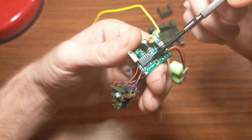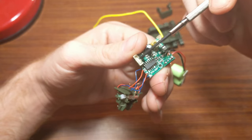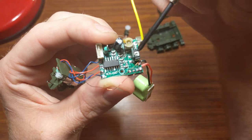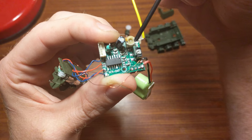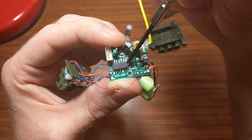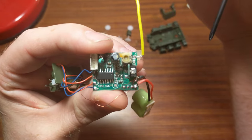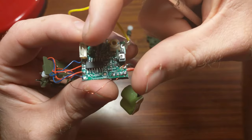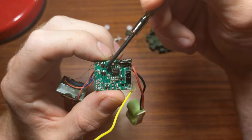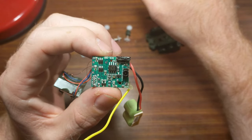This chip on the other side of the board is fairly obviously the chip running the whole show — partly because it's the biggest. This would be running radio communication and the infrared setup, and it's almost certainly connected to the motors. Whether this chip is an ASIC or a programmed microcontroller is hard to say, but I'd lean towards the latter because custom silicon is expensive. There are no numbers on the case — they don't even look filed off, just never there to begin with. Flipping back over, these two little chips here are almost certainly H-bridge motor drivers: there are two of them for two motors, no other obvious motor drivers, and they're right next to the pads that connect to the motors.